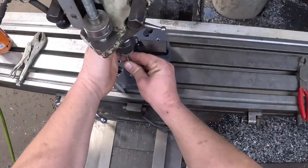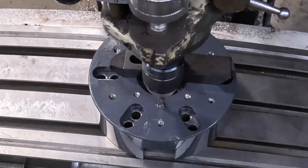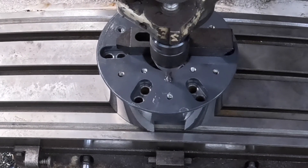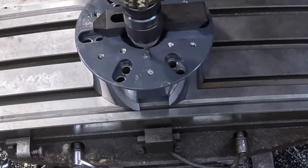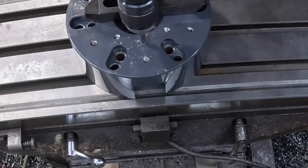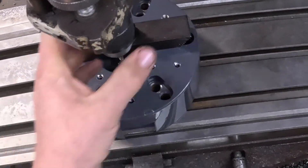We'll do a spot drill to start. What I'm doing right now is getting that top surface where we can actually work with it. If you go straight to the drill on these jagged surfaces, the probability of it giving you issues is pretty high. Watch that drill — see how she walks? I'm doing just light pressure. If you saw how she kind of evened up there and then a couple of chips — yeah. Now we've got a good little spot to get started with and I didn't go too deep or chew off the whole top surface.